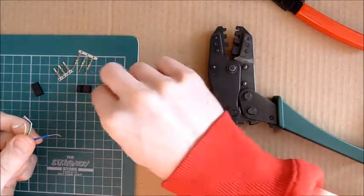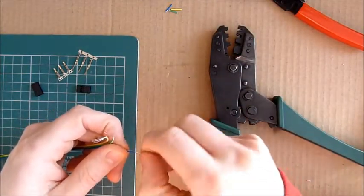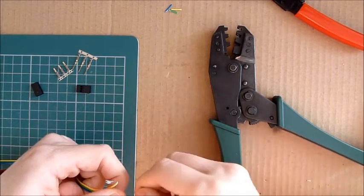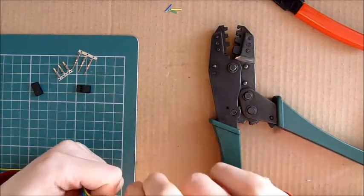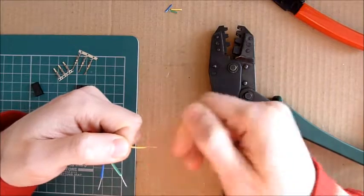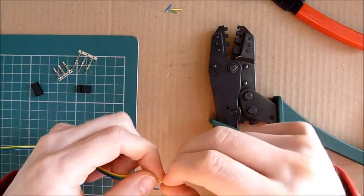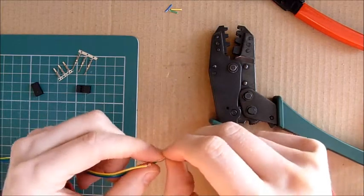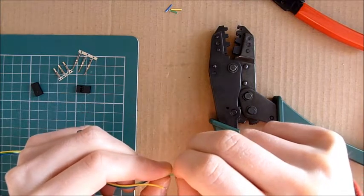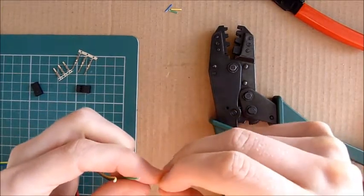These crimpers aren't great - they're just not right for this size of crimp or this size of wire. So they're not quite the right tool for the job, which is why this is still a bit of a pain, aside from the fiddliness of it. I could buy a new pair but I've got no real guarantee they'd be any better. So just twist those. I bend the end of the contacts into three to make them thick enough to be gripped by the crimp. You can get away without doing that, but I like to bundle them up so it's got a little bit more to grip.